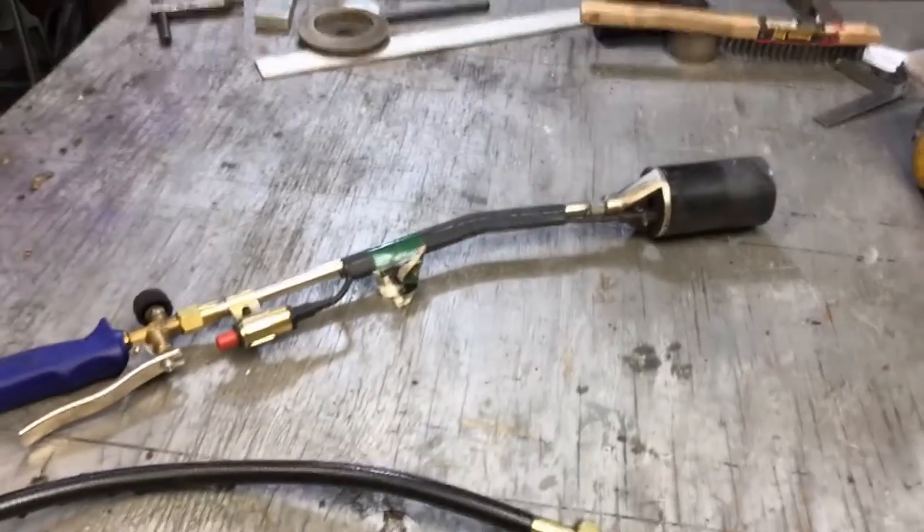You can melt steel, but it's hard to pull off — it takes a lot of fuel and patience. You can melt cast iron no problem. I've built foundries where you can drop pieces of cast iron into the crucible while it's running and it will melt them within seconds. But still, that requires about another 100 degrees, and that last 100 degrees is a monumental feat — you need insulation, air preheat, and everything you've got.